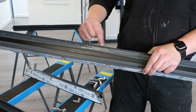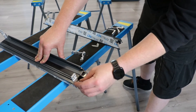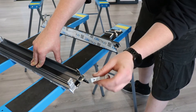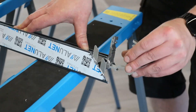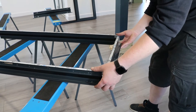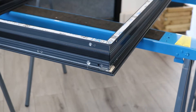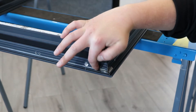When working on the sash make sure the hole is routed first. Then we can put the cleats in: one flat cleat into this side with a hole in the middle, two chevrons — one in the top, one in the bottom — and one sash cleat also with a hole in the middle in this side here. Repeat this process for all four corners. When piecing your sash together make sure you silicon the edges first. Make sure the chevrons line up in the slots provided and repeat this process for the other side. Before screwing your sash together make sure any screw that was underneath the friction stay is countersunk so it sits flat to the profile.